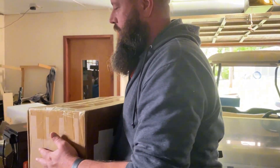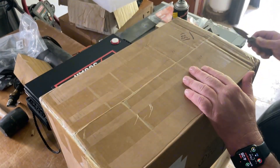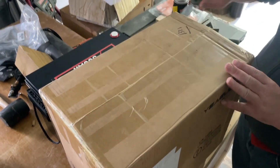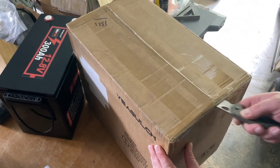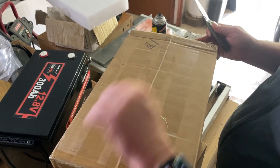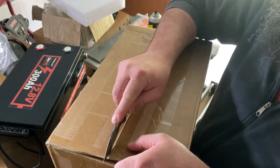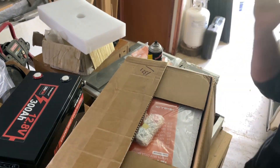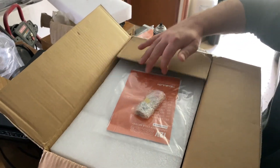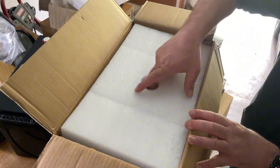You don't want to just stick these new batteries onto the system because these are going to be half-charged while my other batteries are fully charged. So what I'm going to do is disconnect my other batteries since I still have probably about three and a half hours of solar power coming in. I'll hook these new ones up so they can be charging, and tomorrow I will hook them all together.